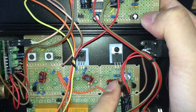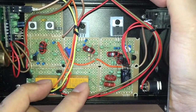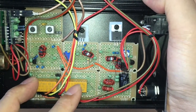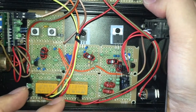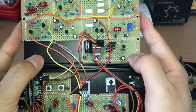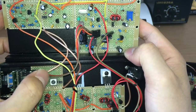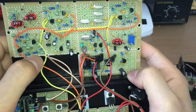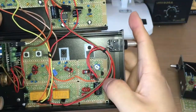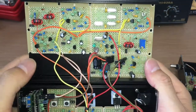This transistor is a BD139 and this is the final amplifier, an IRF510. These two relays are used to switch the antenna signals, as well as the 12 volts and some mute or other applications. The transmit audio is quite good and it outputs 5.5 watts. I also use coaxial cables to connect the major IF signals from this board to this board, and another coaxial cable to connect to the antenna connector.